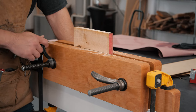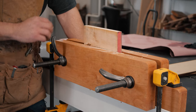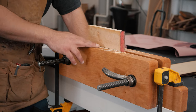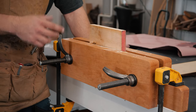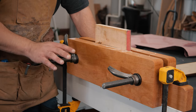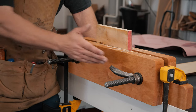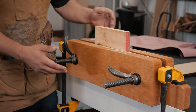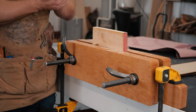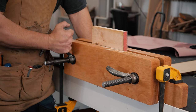There are other types of hand wheels on McMaster Carr you can look around for that will be more expensive, but they may be more your style. This is the cheapest way to make a hardwood Moxon vise, and it works incredible. My other one — same exact size jaws — if you want to build that one, it would be the same plans and same order of operations. That one I attached the handle to the all-thread and used the all-thread to go through, which gave a wider clamping capacity. Either way, these things work just perfect, and when I built mine, it was one of the most useful things I put in my shop. Stay safe in the shop, have a wonderful day, please subscribe if you're new here, and we'll see you on the next one.